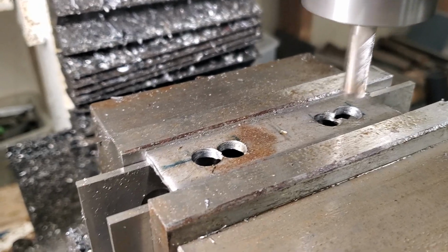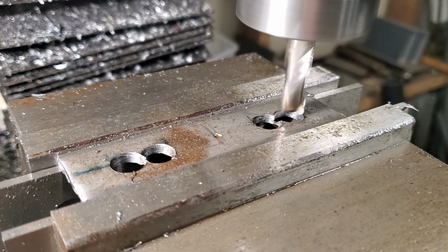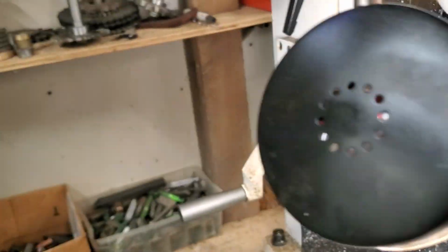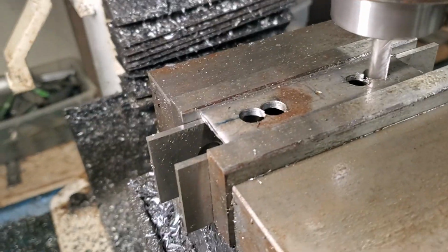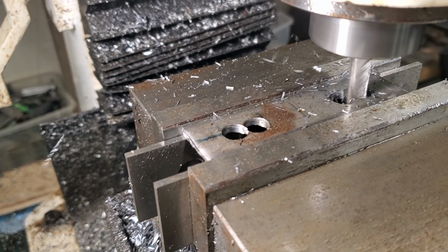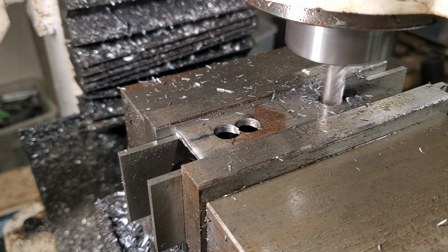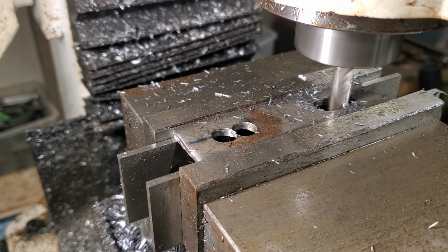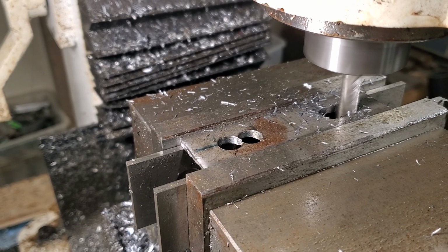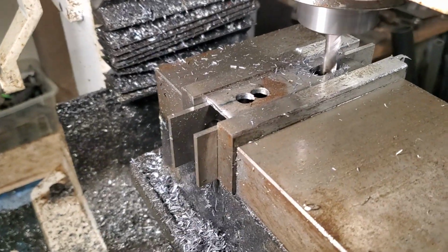That's about 1700 RPM. I'm going to lower that head down in there and it should be centered up. Just like that. I'll lock it in place. Now that bit was a 64th larger than this cut head. So what I'm gonna do is clean that out after I take it out of this one.